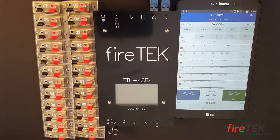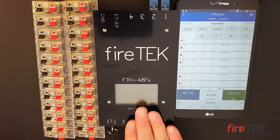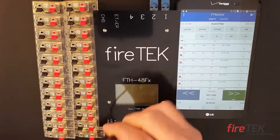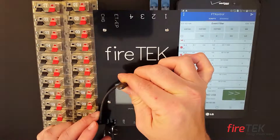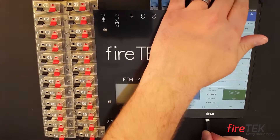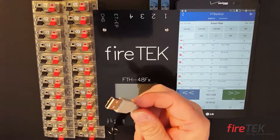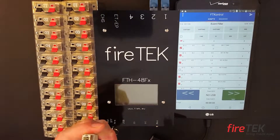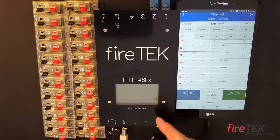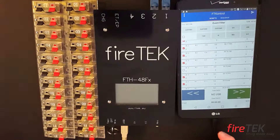Today we're going to get your script from your tablet to your modules. You're going to need a couple of cables: a micro USB-B to a female Type-A connector that goes to your tablet, and then a male Type-A to an older Type-B USB connector that will go to your module, just like you would use on a PC. Plug those in together and start your power-up process.